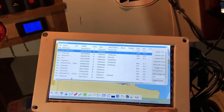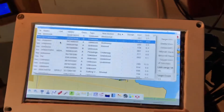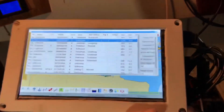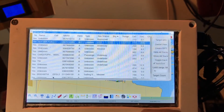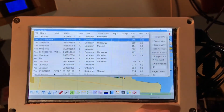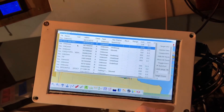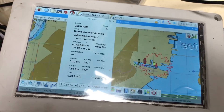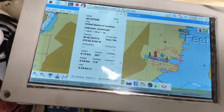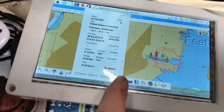I've moved to my boat yard and added a cable to the Daisy AIS receiver. Now I've got about 13 different targets on my list. Apparently names are only broadcast every 6 minutes, so names are a little slower to enter into the system. Here is an AIS alert showing me that there's a boat headed in my direction, and I can acknowledge the alert or silence it.